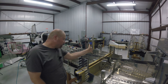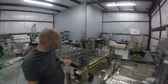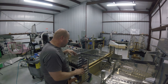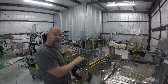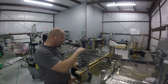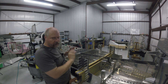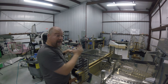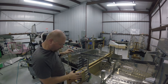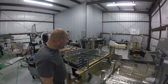I'm going to have to go in and figure out how to get those 20-something remaining rivets finalized. That's probably going to be a matter of putting this thing up on its side, clamping it in place, and having my wife help me buck and use the gun. It's at a position now where I can move on, which I think is going to be putting the bars in place and putting these side stiffeners on. I did put these side stiffeners on out of order from the plans specifically to give it stiffness — they add a tremendous amount of stiffness to this structure, which really made the whole lifting up and putting down thing much easier.